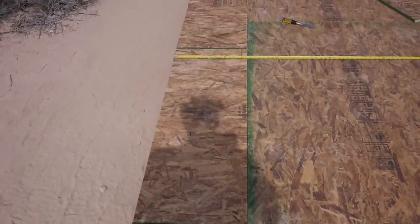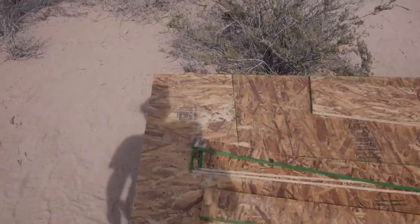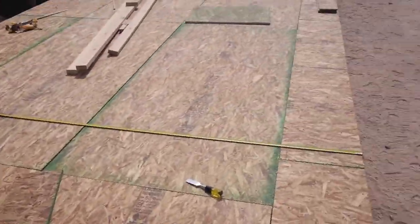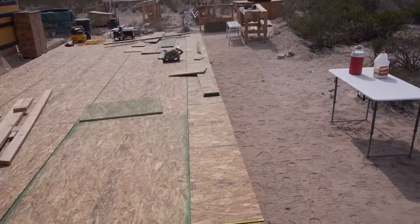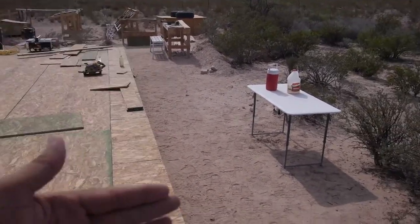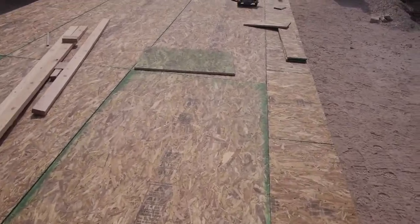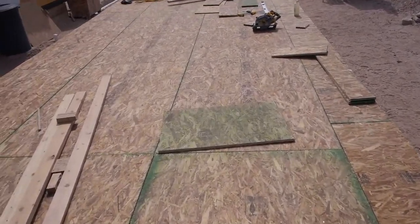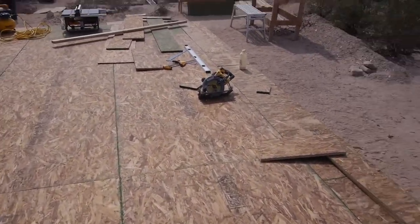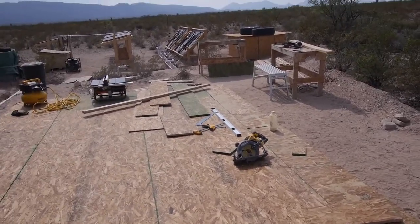Now, as far as the work platforms, countertops, and so on, if I feel like they aren't solidly supported, I'll just run a 2x4 rail underneath them. So, put down a 2x4 and then put the shelf right on top of it to spread the load out. Some of the stuff, like storage, is going to be kind of heavy, so I'm going to set it up so that I spread the load out more than just sitting on one spot. I think that's going to help.